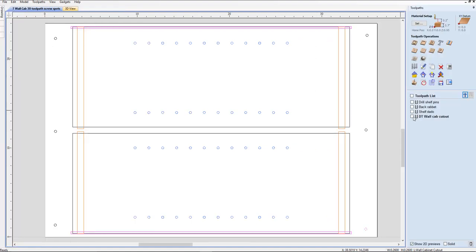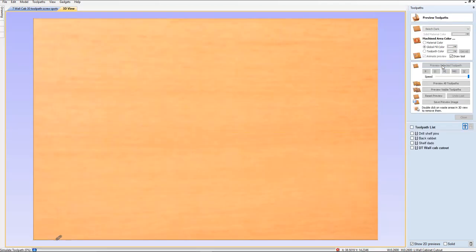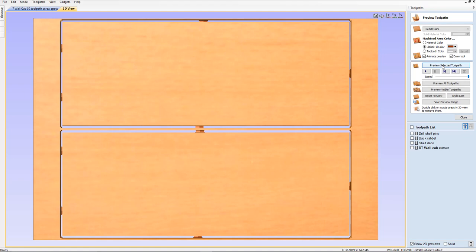We'll go over to this side. Let me do one thing — go right over here. We're going to go ahead and preview this tool path right here. Notice I've already put in the tabs and all the cutting files here for you, so you don't have to repeat that. But when you're putting tabs and you have a small amount in between, it's good to put the tabs right across from each other, because that will hold this in place. We've got one in the middle here. What happens if we do not put any tabbing here — even though we cannot put any screws here because it's too thin — this piece will start vibrating as it's being hit with a bit, sometimes it will break off, that piece can come up and jam into the motor, and you can lose your position.